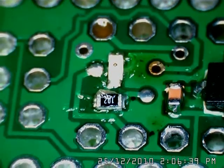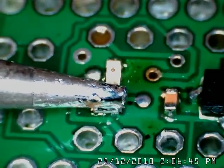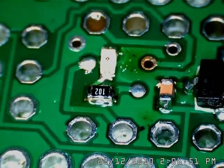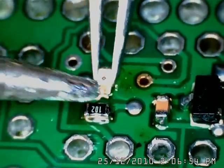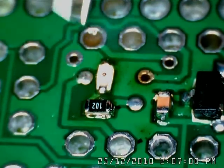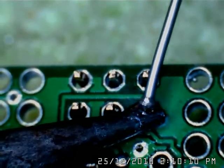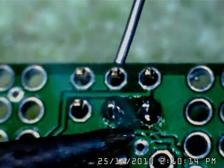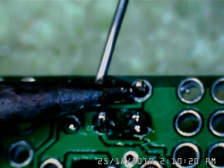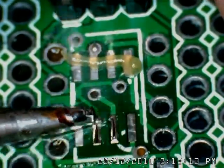Now the LED and resistor on the I/O pin. My preferred method for doing resistors is simply that. Then we'll do the LED as we did before. The only through-hole parts are the six pins for the programmer. I'll tin the pads to make it a bit easier.